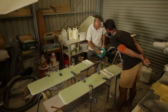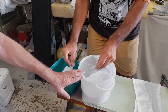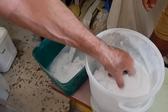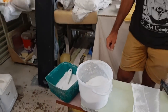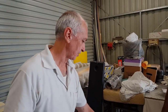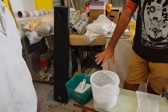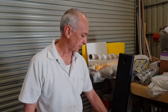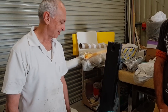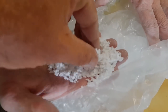David showed us the epoxy additives he uses. In the green container on the left was cotton flock and cabosil, which is for gluing. In the bucket on the right was cabosil and Q-cells, used for fairing. This stuff goes rock hard — virtually impossible to pull apart once you get it going. The cotton flock amazed me with how expensive it was — it's basically sweepings off the cotton mill floor, but you buy it in a bag and it looks exactly like what you'd expect.